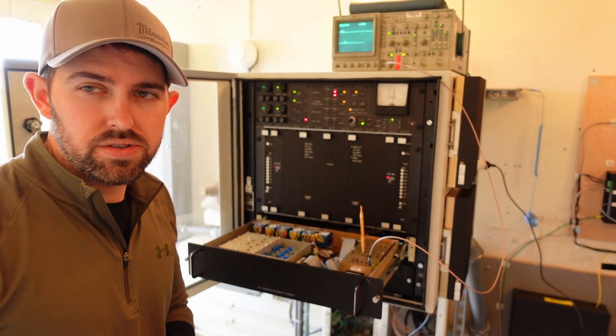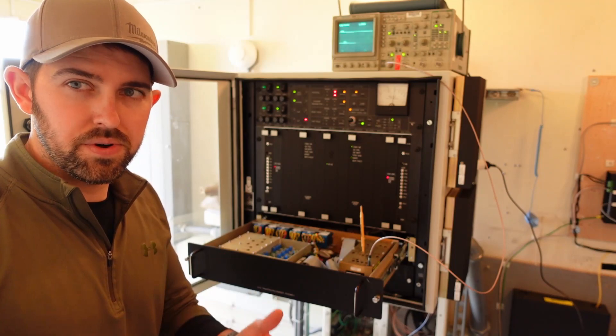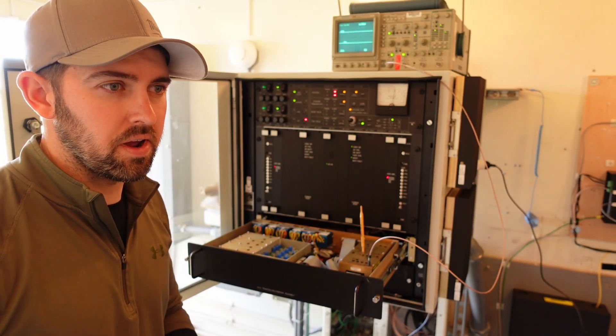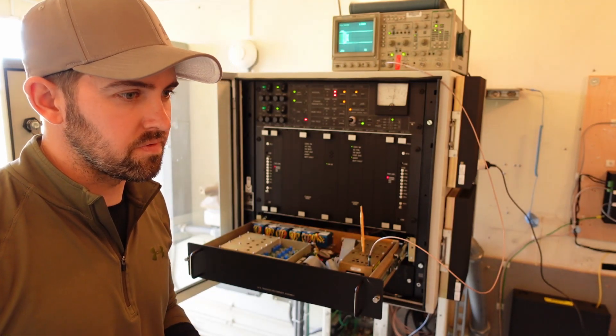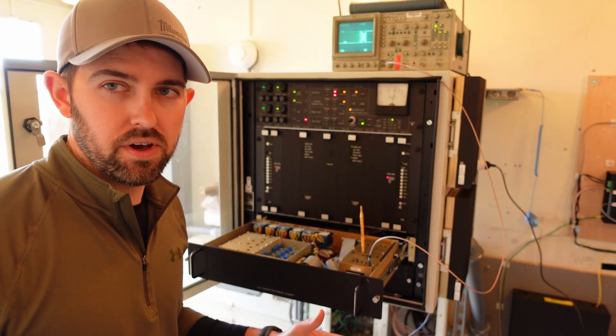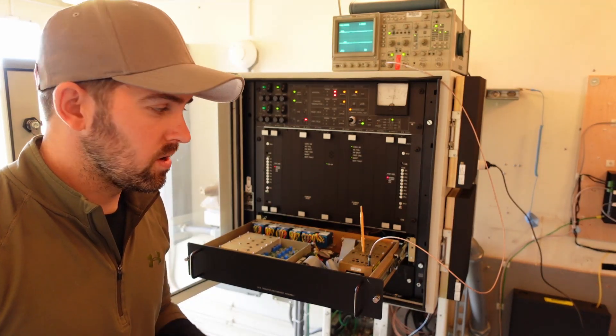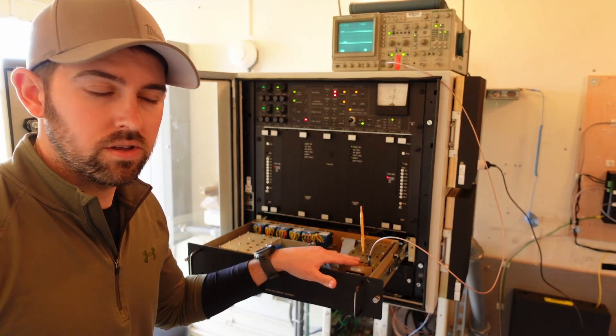Now that all of our cable links are adjusted out at the DU, on the transmit side and the monitor side, we've got our center lines established. We've been out into the far field and the near field. We've phased this system. We've verified our course width and clearance widths. Now we can optimize our monitor recombining unit here.